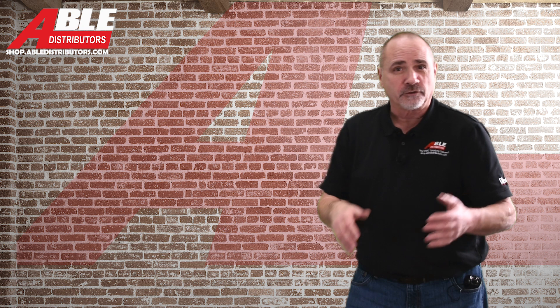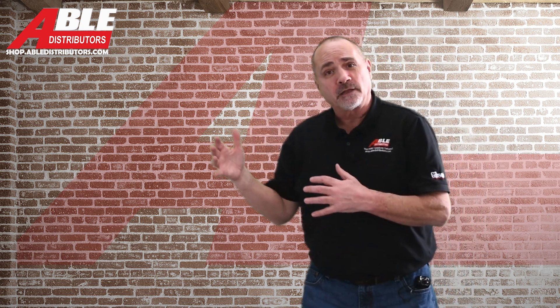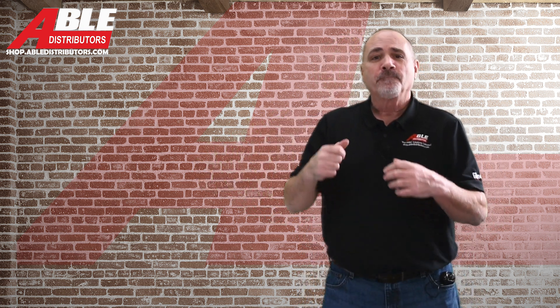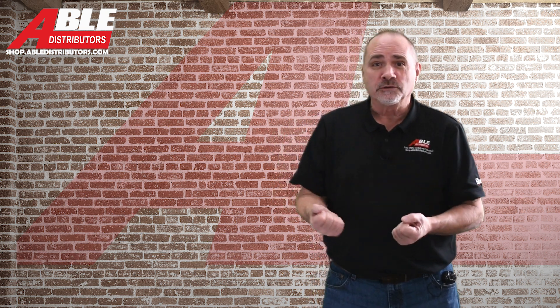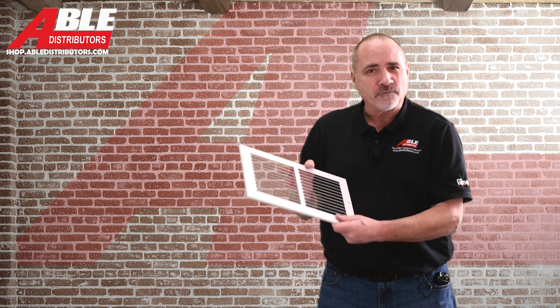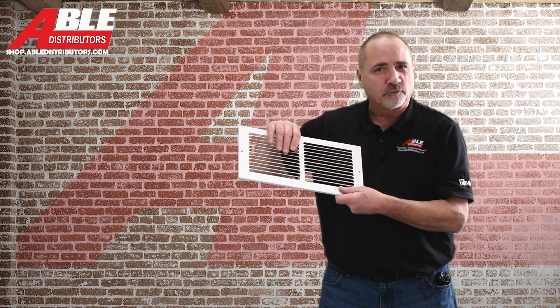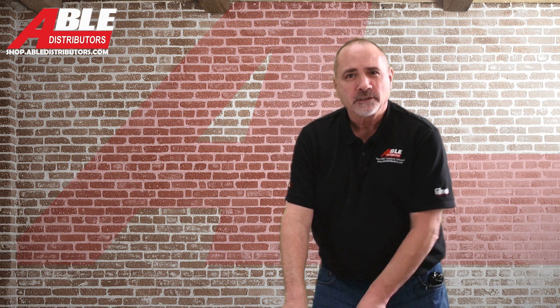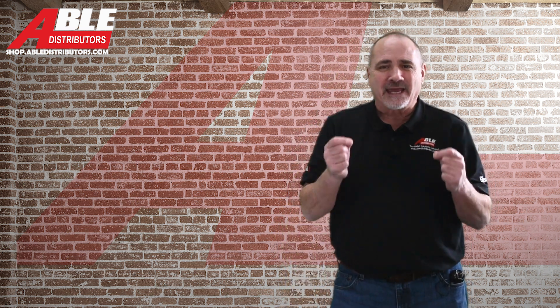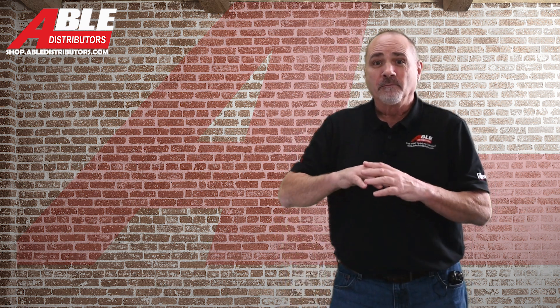This house had seven returns in it. My static on the return side was a little high, so I checked one and that one went from 0.056 down to 0.011 — I thought that was a huge difference. So I changed out all seven grills to the wider spacing and cut off 0.21 on the static on the return side by doing nothing but changing out the grills.